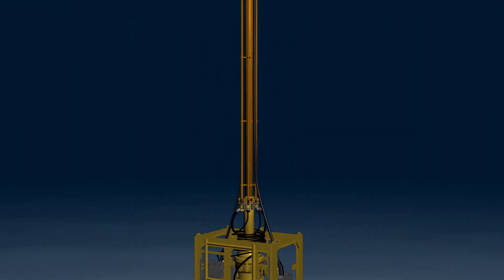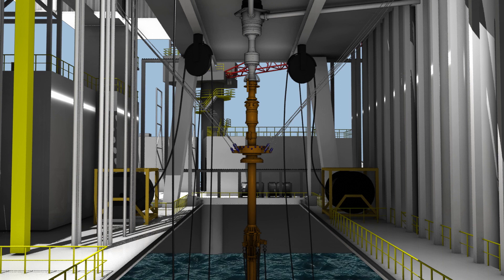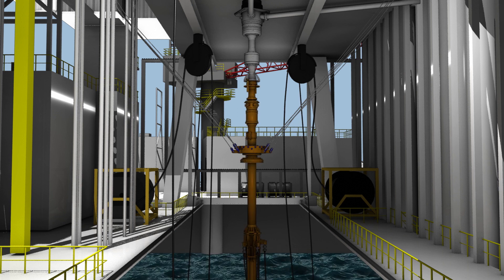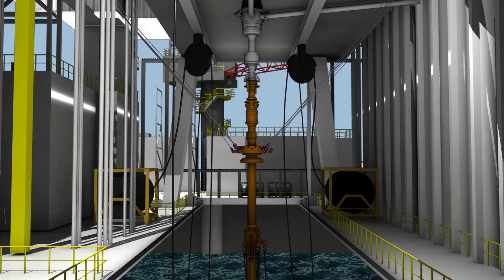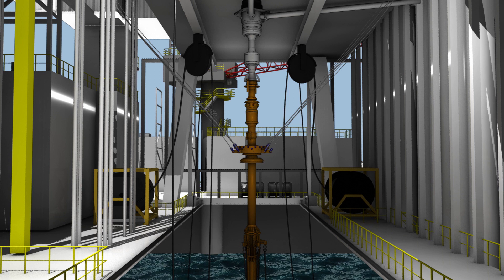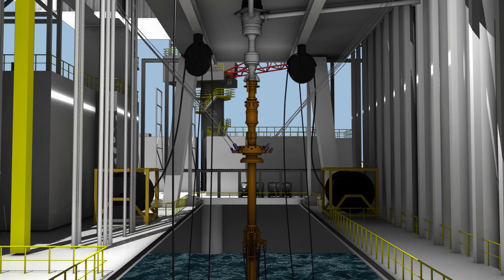The riser allows fluid communication through the water between the stack and the rig. At the top of the riser, hydraulic hoses are connected to the termination joint. The tension ring keeps the riser straight, and the telescopic joint and the flex joint compensate for the movement of the rig on the sea. The diverter helps direct high pressure away from the rig at the surface. All this equipment is operated using hydraulic pressure, electric power, and network communications managed at various locations on the rig. Together, these products are designed to provide reliable methods of controlling pressure during drilling operations.